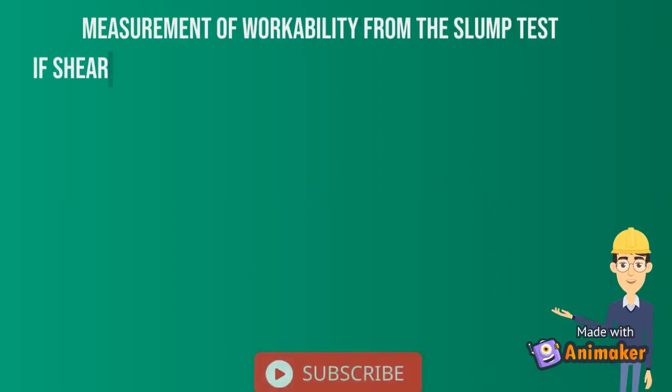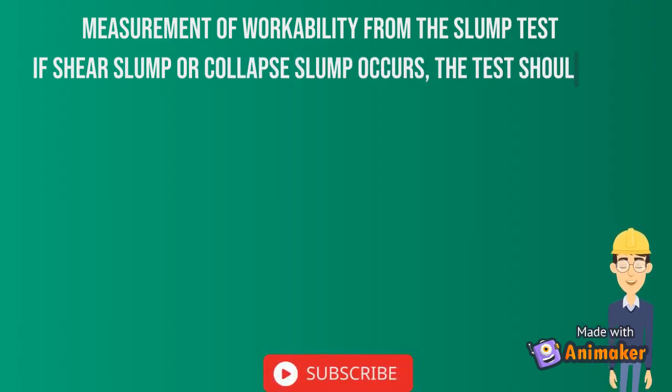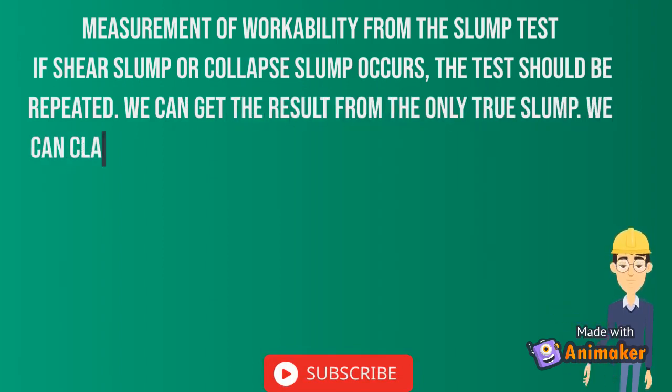If shear slump or collapse slump occurs, the test should be repeated. We can get the result from only true slump. We can classify the result within some ranges according to the slump value.